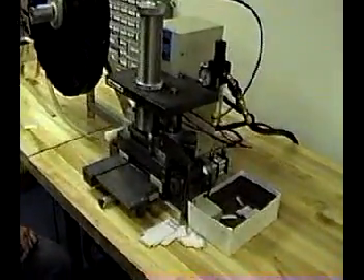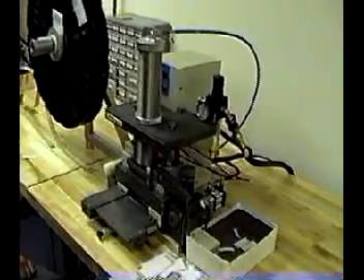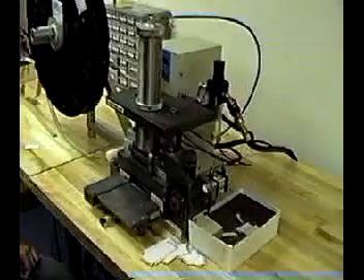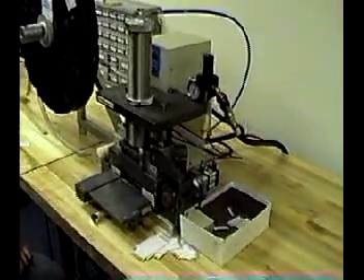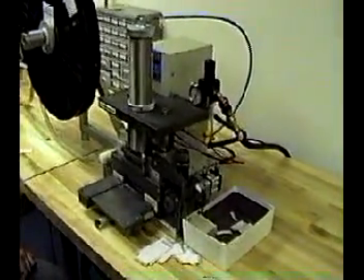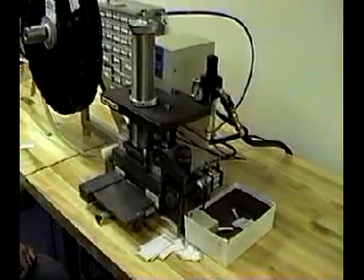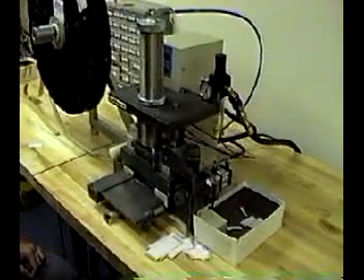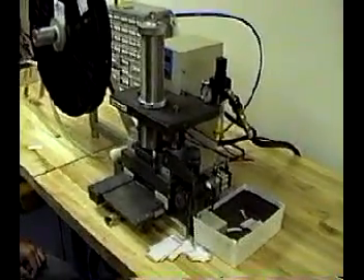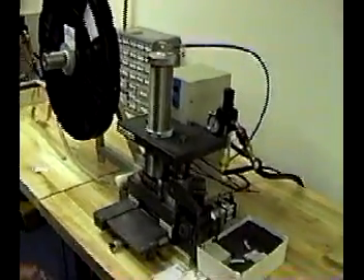As you saw, the machine only takes a moment to change the number of contacts. The reels come with 35,000 pins per reel. You have to remove the small work loader to replace the reel, and that generally takes up to five minutes for an operator to accomplish. It's an extremely reliable machine, very robust — there are very few items that ever go wrong or even have to be maintained. It's very reliable, very robust, maintenance-free almost, and very fast. If you have any questions, please give us a call at 215-444-9580. We'll next have a short pause and be showing you the manual version of the machine. Thank you.